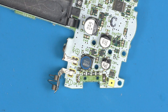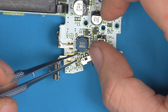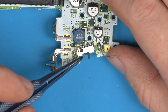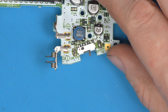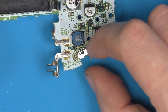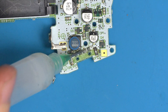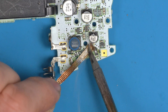That's the old switch off. To position the new switch, you want it centered to the cutout on the board. You can see that once it's in position, the pads line up — not absolutely perfectly, but close enough to blob solder on just fine. What I find helps is instead of leaving the old solder on, get a little bit of flux and clean up the inner pads first.